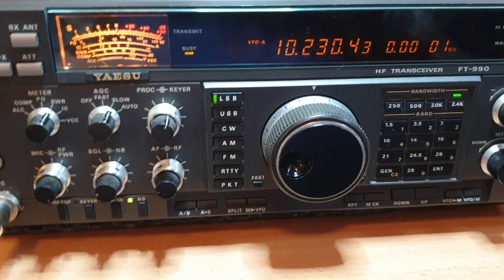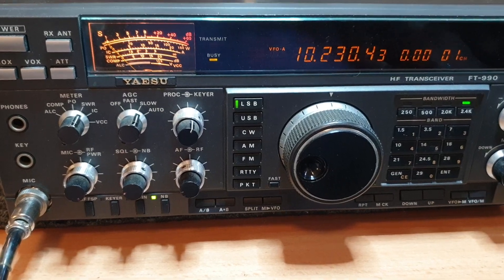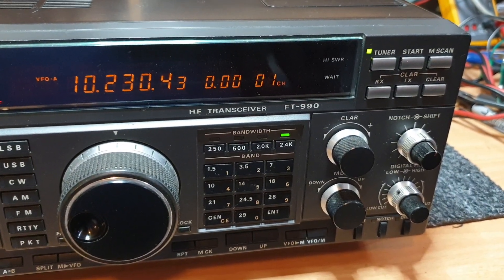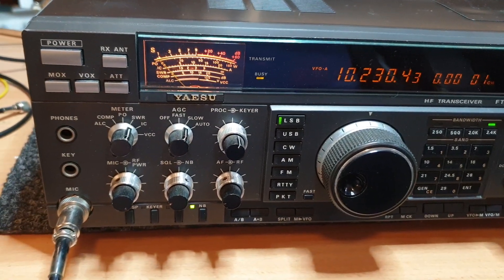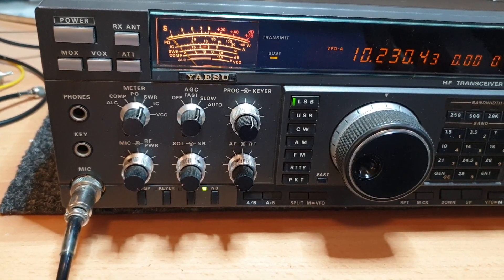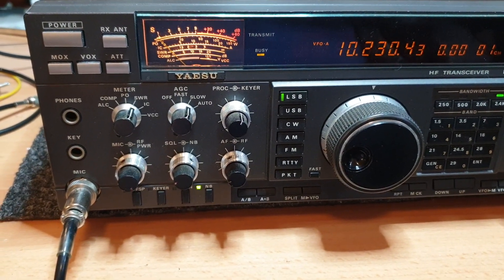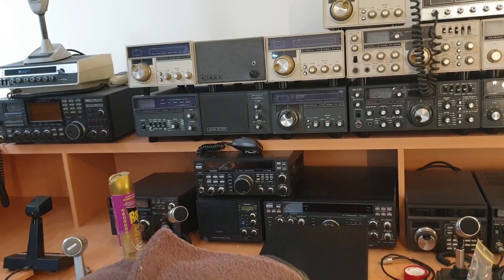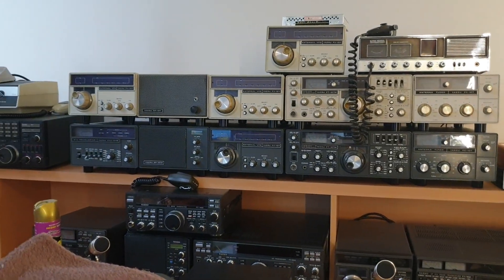Effectively they're just making a match — it's obviously not going to be the best antenna on the market to put on here. Get antennas that are suitable for your radio. This is really quite a nice radio. We'll put some screws back in it, box it up and send it back to my good mate. I thought I'd just do a bit of a review of the FT990 now working with no Mars Mod — just to show you that once you remove that solder joint, all the bands still operate as they should and work quite well. Very much a favorite of mine. There's a full FT990 set up over there — I love the things. 990s, 102s, 107s — love the whole lot of them.